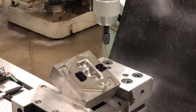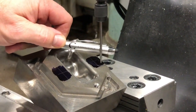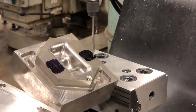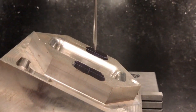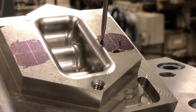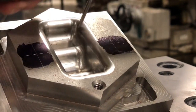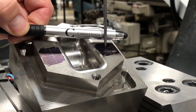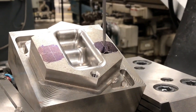I'm going to turn this on at a thousand RPM and zero my piece out. I can leave it on so I can see that it moves when I bump in. You want to get as close as you can without hitting, and bring your Z down as close as you can. Zero that out again, bring it down again — right about there. That looks about right.